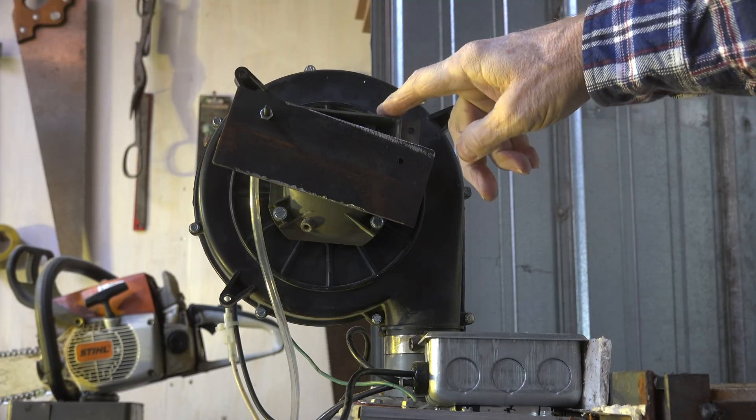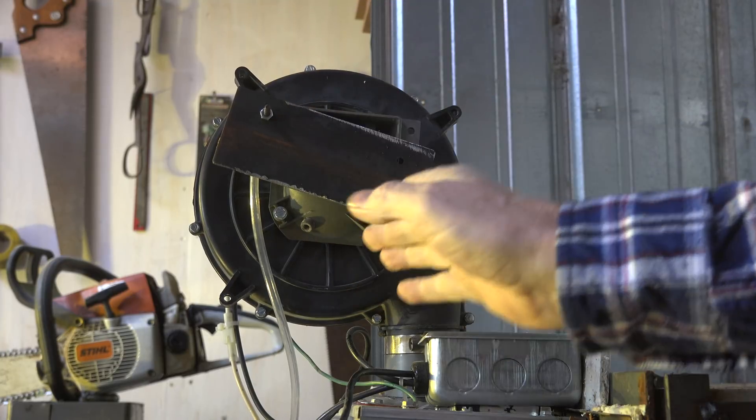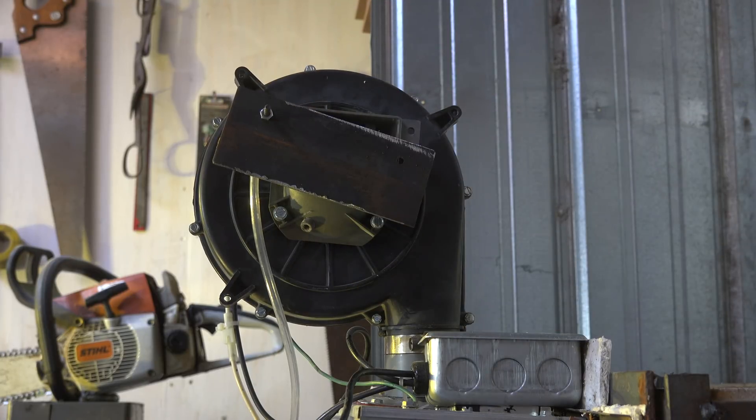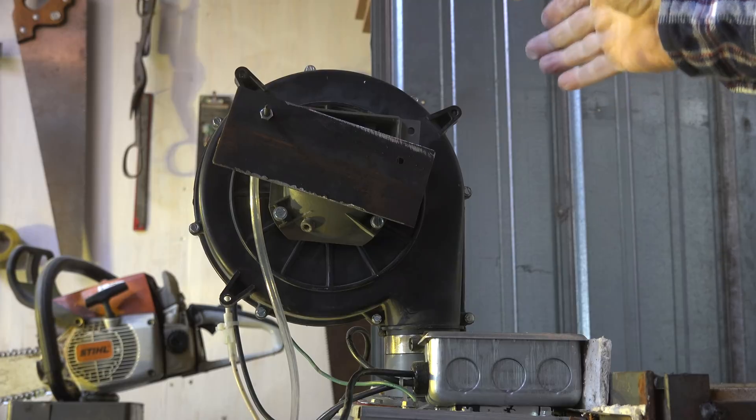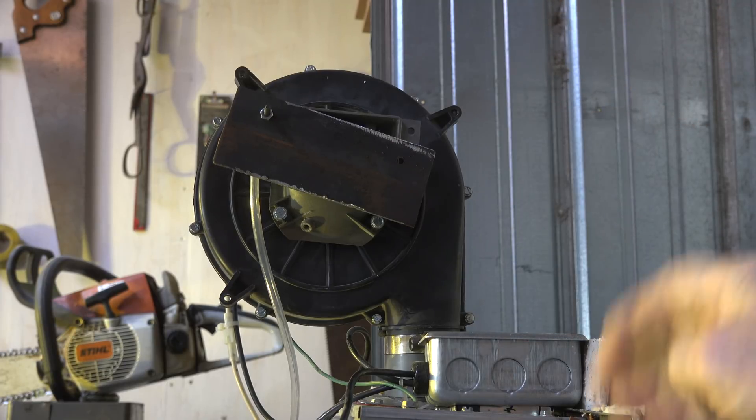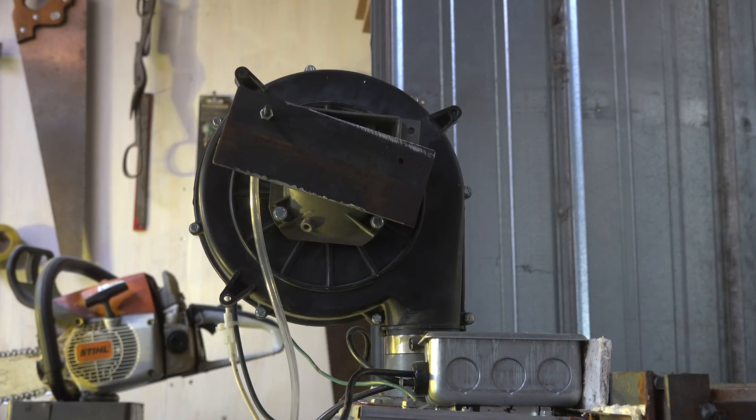So this is all set up. If you left it wide open there would be too much air moving through it and the burners would not light. You have to cut off the air somewhat — it's a cut-and-try sort of thing. You get all this stuff mounted up, and next I'm going to go into the safeties that are put on this thing and how they work and how I've had to change the safeties to make it work properly.